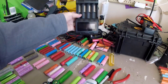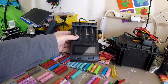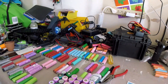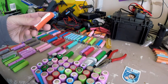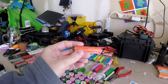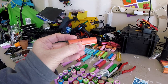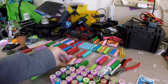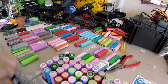I picked up a couple of different chargers — I'll probably do a review on these — but these are 18650 chargers and testers. They'll do about a 24-hour test on all of the cells. They'll give you the voltage, charge the cell up to 4.2 volts, give you the milliamp hour, and also the internal resistance.